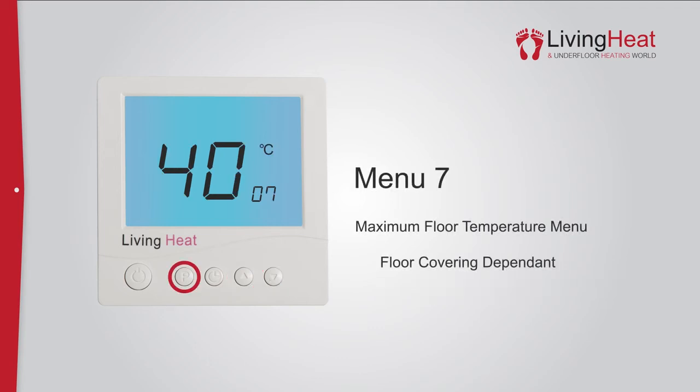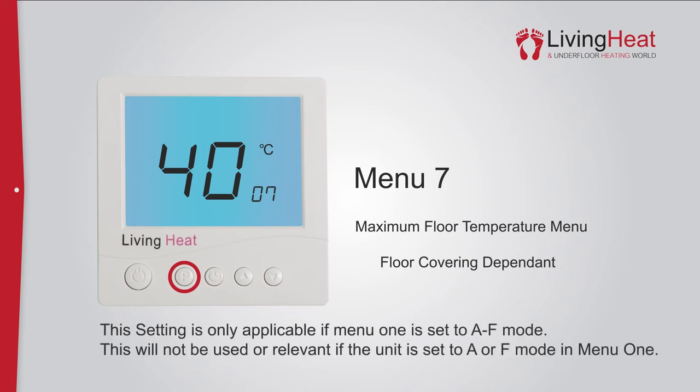Menu 7 is max floor temperature. In this thermostat, if it is set to AF mode in menu 1, then the thermostat will not allow the floor temperature to pass the set point set in menu 7. Please note the thermostat will ignore the temperature set in menu 7 if menu 1 is set to either A only or F only modes. We would always recommend knowing what your floor covering max recommended operating temperature is, so you can set your thermostat accordingly, as some floor coverings are more sensitive to heat than others. Use the up and down arrows to select your desired setting, and then press the P button to move on to Menu 8.